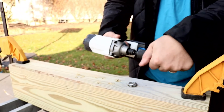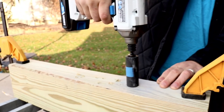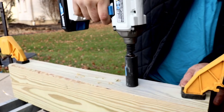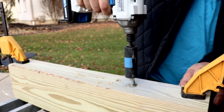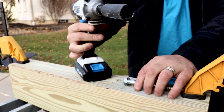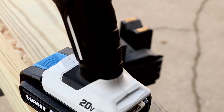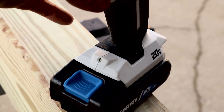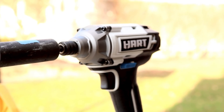It did do the job — it brought it all the way down. If you had a pilot hole you shouldn't have any issue, and remember it is a 1.5 battery. But that is not the concern I had. The concern I had is this is not one mold for the casing — it is two pieces put together. When I had the half-inch lag and just kept going with it and beating down on it, I could feel — not much, but a little — separation between the two pieces. If you look real close between the black and white stripe where the two pieces come together, you can see they're shifted just a hair. Putting these through heavy-duty lags without pilot holes or heavy-duty industrial use, you're going to have that issue.